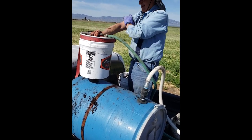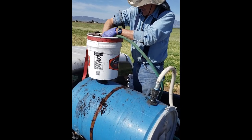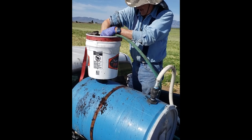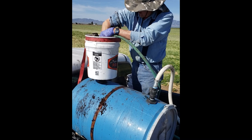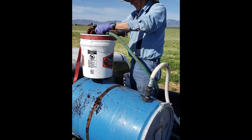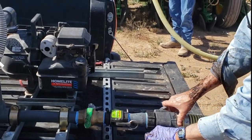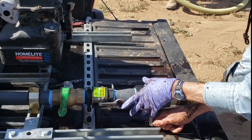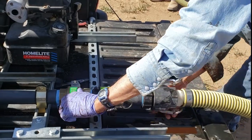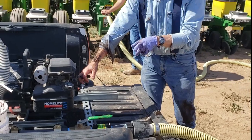You just do this over and over. I usually do about 30 pounds per 40 gallons, and when I'm done, we will mix that in another tank to get the desired volume for applying on the field. We usually put it on at about 20 gallons per acre. Most injectors on equipment will accommodate that. Here you can hook up to this unit to transfer that concentrate to a holding tank on the planter.